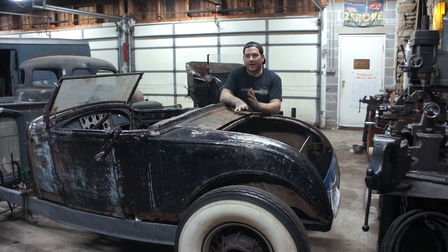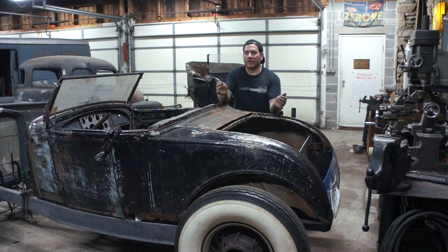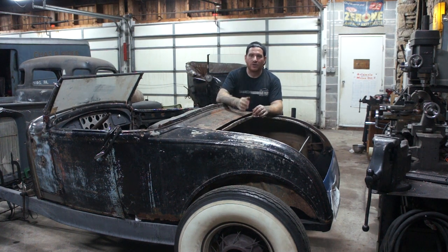They are hitting on the center X section, and they're also way too long, the wishbones. So we need to cut them down, and then I need to either heat and bend them or pie cut them to change the angles that they sweep in and connect to the center X set, the cross member in the frame here.